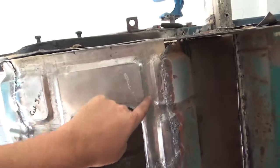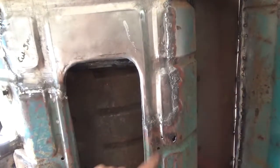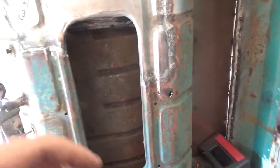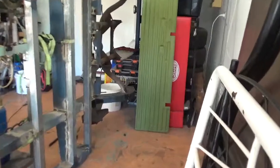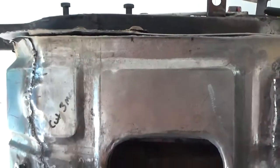As I said earlier in another one of my earlier videos, I had a bead die or bead roller actually made up for me. I took some measurements of that floor pan, and that exact same measurement is roughly the same as this beading here. So it's worked a double whammy for me. I'm going to be able to get most of my beads in the body work as well with that one bead that I've had made up. That cost me $100.